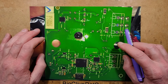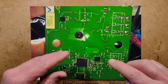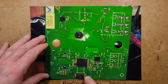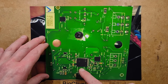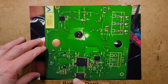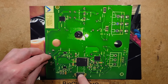It turns out I actually paid the full price of about 380 pounds for that unit. The circuit is now flipped over, and that connector close to the hole is black but it's actually plus 24 volts. I think they may have had a problem with the wiring looms being mispinned and fixed it by turning the connector around to reverse polarity. There's also a surface-mount class Y capacitor mounted at the edge of the board — when I opened the unit this was actually just hanging off the circuit board by one end, because the board sits in runners and puts a lot of pressure on it. I desoldered and re-soldered it, then reflowed it and moved the component away from the edge.